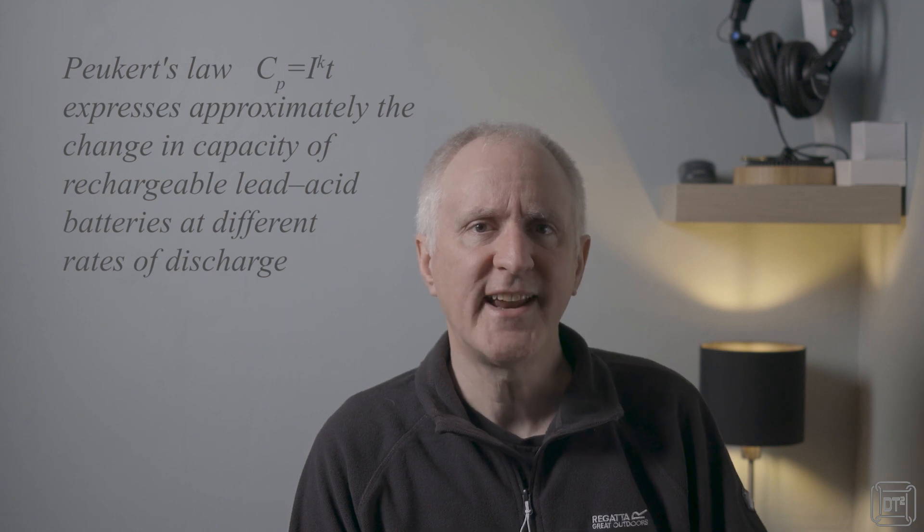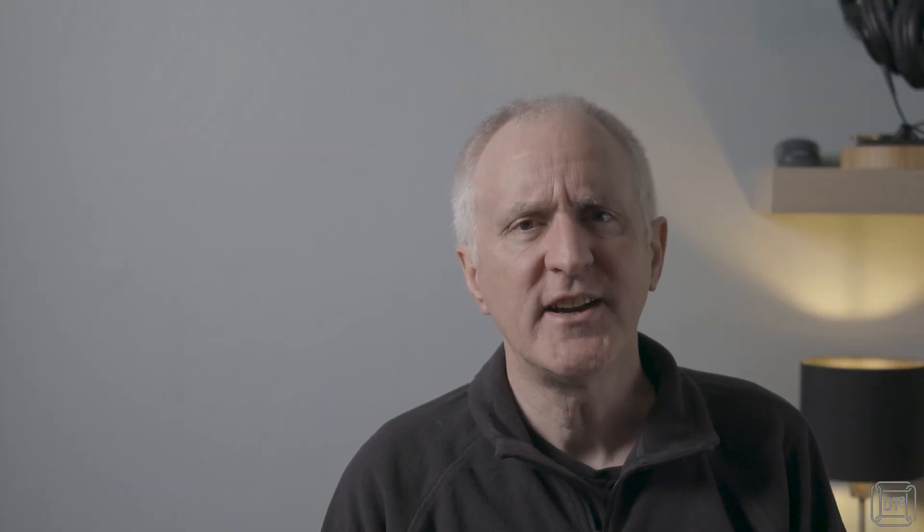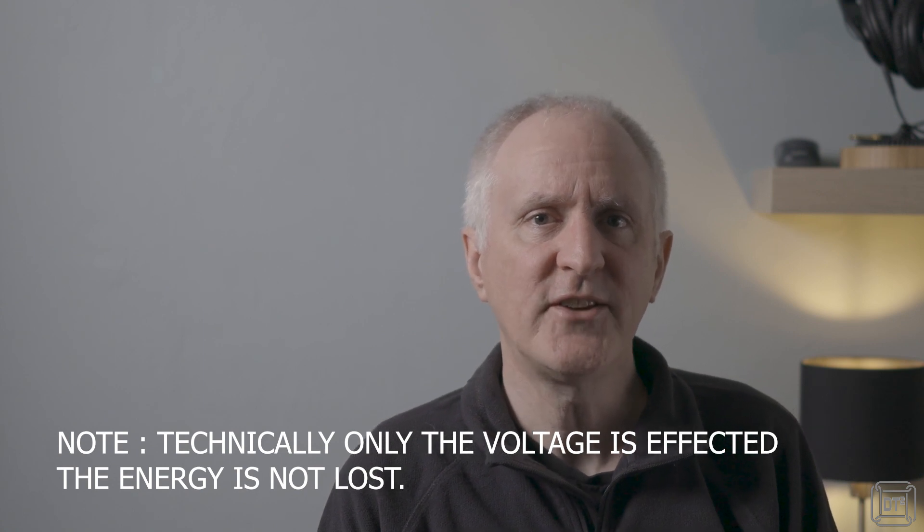How your battery delivers power can be a more important differentiator than cost in some use cases. Both AGM and gel batteries can handle higher current draws than standard wet lead-acid, so if you need to use high current devices such as motor movers or inverters they make more sense than a standard wet battery. However, all lead-acid batteries suffer from what is known as the Peukert effect. Simply put, due to its chemistry a lead-acid battery can provide more power if drawn slowly over a longer period of time. Conversely, subjecting a lead-acid battery to a high current drain will actually reduce the effective capacity more than the actual power consumed. Lithium batteries have a completely different chemistry and do not really suffer from the Peukert effect, meaning they can still deliver similar total capacity whether used for high or low current purposes.